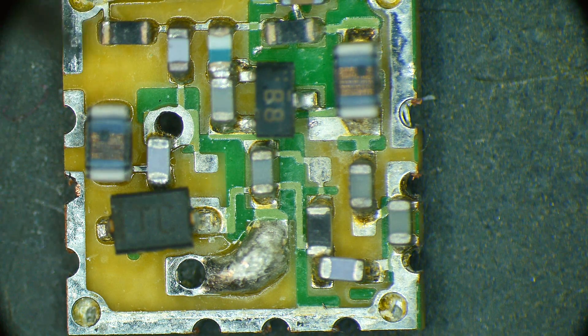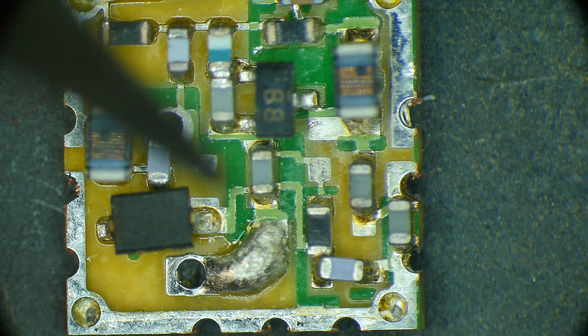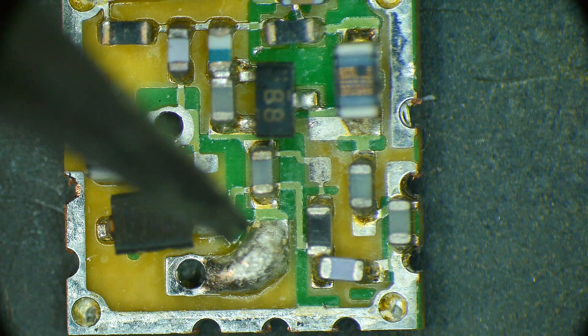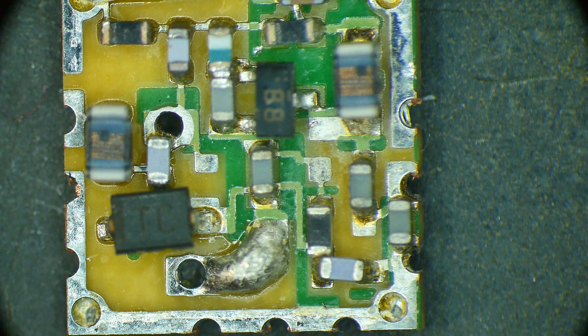There's an input here, over there, and up at the top. Now the interesting thing is there's this big giant blob of solder here - it's a really big blob of solder - and basically it says that this node right here is ground. There might have used to be something there and they decided to just short it out. And there is an active component - what looks like a transistor. I tried to test it and it's a diode in one direction but not the other direction, so I don't know what that is.